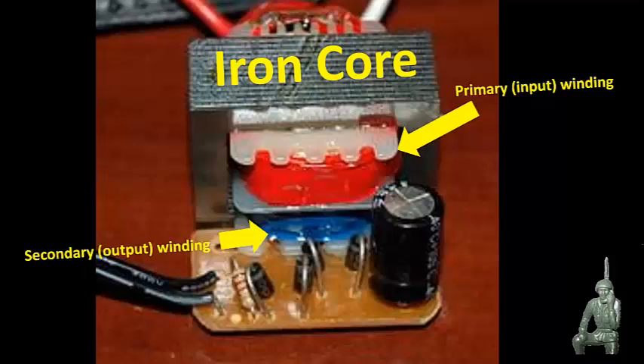What's inside one of these things? Well, here's one ripped apart, and it doesn't look like much. You have a transformer wrapped with an iron core. The red tape there is wrapping up what they call the primary or input winding, and the blue tape towards the bottom is wrapping up what they call the secondary or output winding of the transformer. This is just copper wire wrapped next to each other, and kind of like two magnets repel each other, when voltage and current build up on one winding it creates a magnetic field, and it repels electrons on the secondary winding — inducing a voltage on the other side without actually being physically connected.